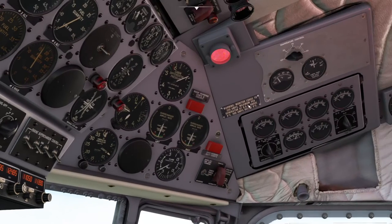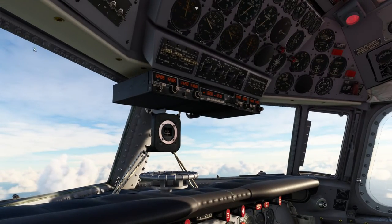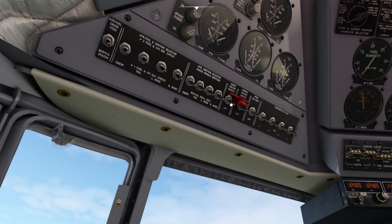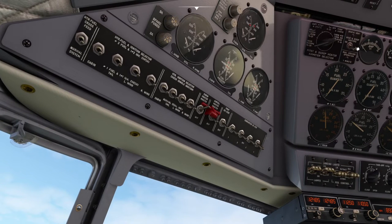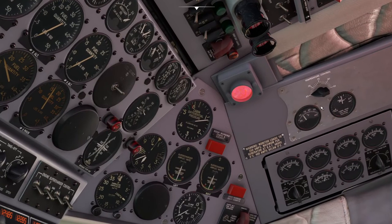Fairbanks is at an elevation of 439 feet, so we set the destination altitude to about 400 feet, and the pressurization system will automatically depressurize us as we come down in time for touchdown. The cabin is comfortable at 65 degrees. We can turn on our cabin heater to get the passengers some air. We should probably put our pitot heat on even though it's okay. We'll turn the temperature up to 70 — you can see it's starting to move already.